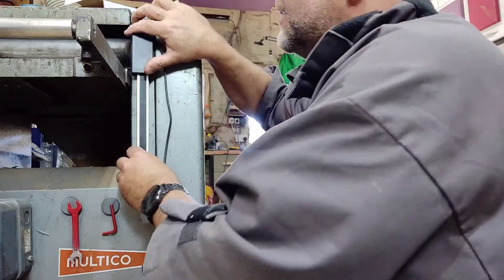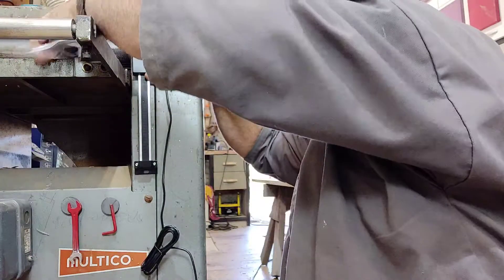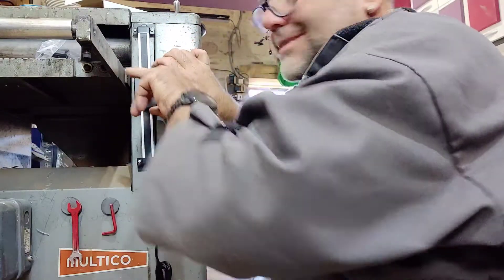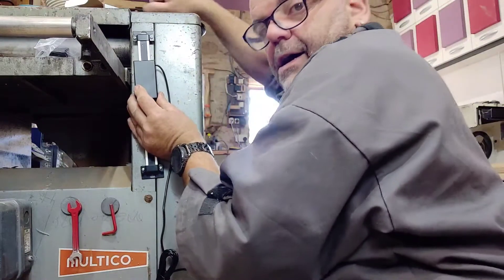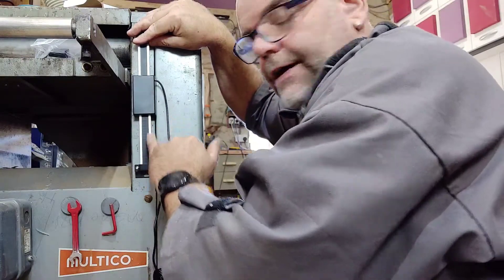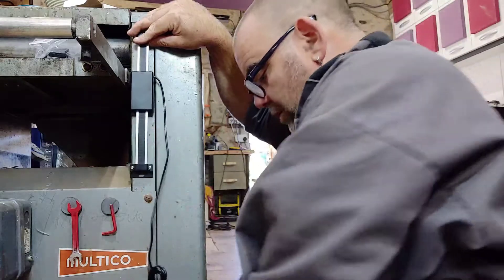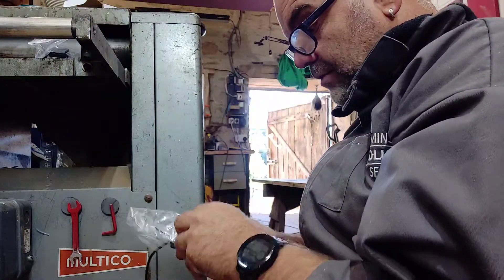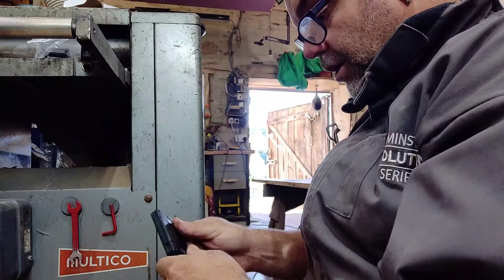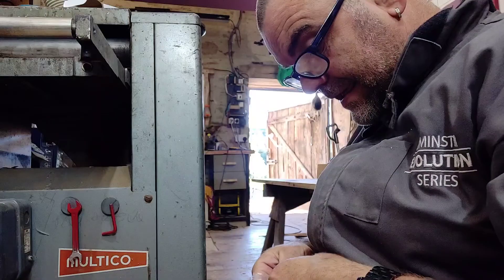Cast iron self-tapping — great. I'll find a way; bolting straight through might be an easier option. From that, you get another part of this device that fixes the sliding portion to the table, so the table will move up and down. This will literally just move up and down the rail, and the segmentation of the rule portion transfers a signal to this portion, which then remotely transfers it to the actual readout itself. This is a remote readout, which for 45 euros I thought is actually a pretty good buy. I just hope it's going to work. Does it come with batteries? Yes it does.